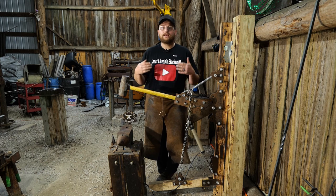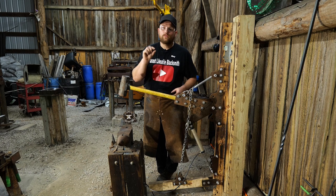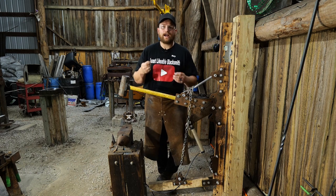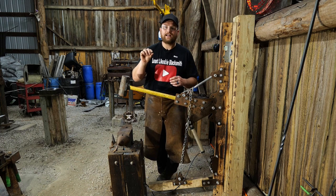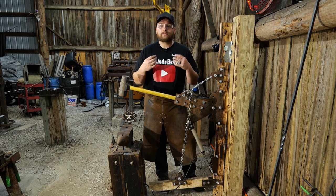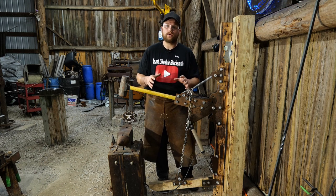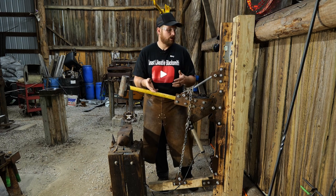The reason for this is once we put on the spring and everything, when the hammer comes all the way down we need there to be a small gap that provides that extra little bit of whip at the end of the hammer stroke. It's always good to set that up to where it's just a little bit toe-heavy. Once that's done and we've drilled holes and bolted it together, let's look at how the hammer actually operates - it operates via a spring and an air cylinder.